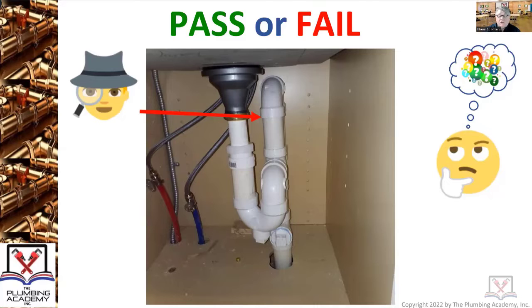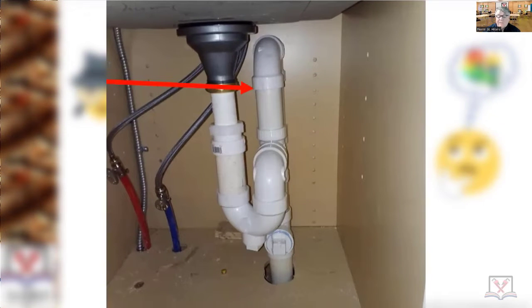This is a really small kitchen sink base in a really awesome big house. Not the best craftsmanship in the world by the plumber. As you look at the holes in the cabinet, no flanges. This is for a finish in a house that costs $1.4 million. I look at that cabinet base and there's a ferrule on the floor, oversized holes, no flanges over these giant holes. So eventually rats and stuff can get up into the cabinet base.